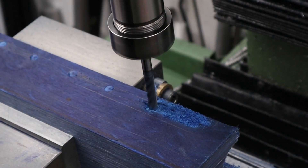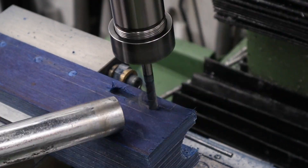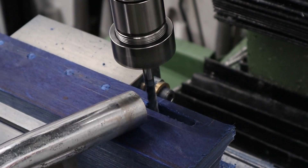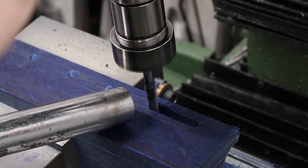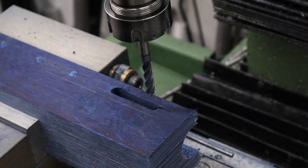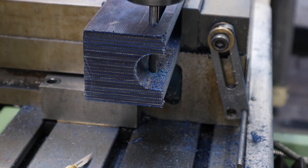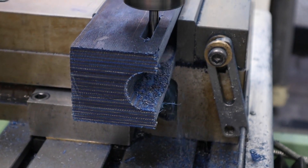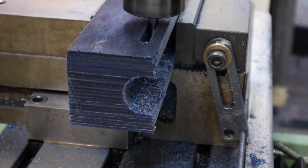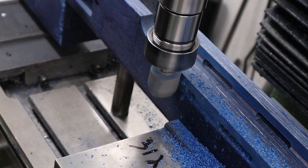Once the front of the stock was flat we could put in some decorative slots in the side of the stock and to do that we're using a long 8mm end mill, coming through and plunging the layers out two at a time. I took this fairly slow as I didn't want to risk busting out the back side of the stock into our newly milled cylinder well. I did both the top and bottom side of the stock in one operation — to save setup time and to make sure the slots lined up perfectly on either side. The stock itself is fairly deep at 64mm as supplied from Lamina, so the long end mill was a necessity.